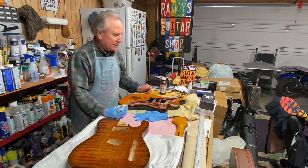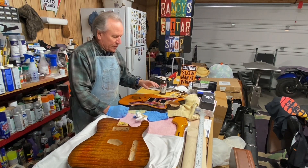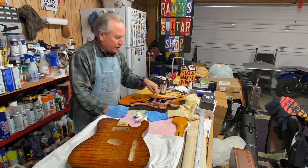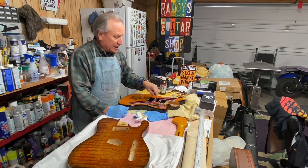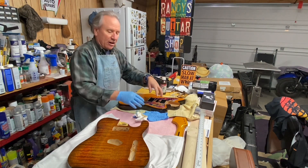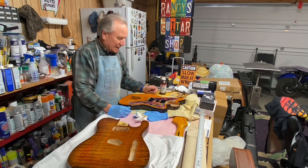We've got most of the parts for this guitar. One weird thing is it has P90s that screw into the body, so there are no pickup ring screw holes — two for the middle pickup, but the others just kind of float. It's going to be tricky to wire. I'll have to make one of those little cardboard templates, put all the electronics on that, solder it all together, then transfer it over.